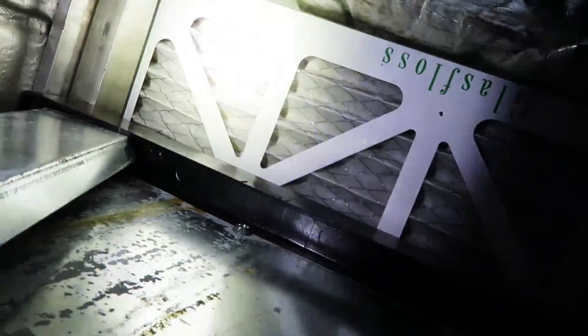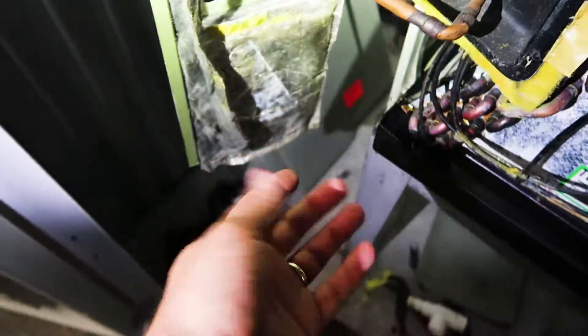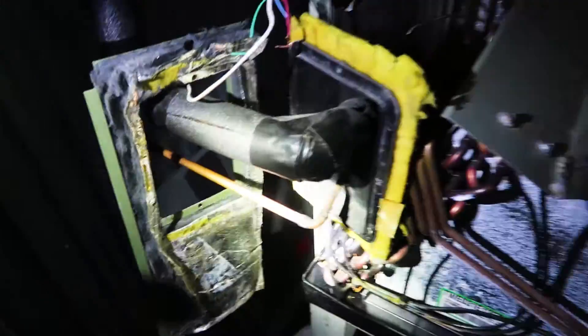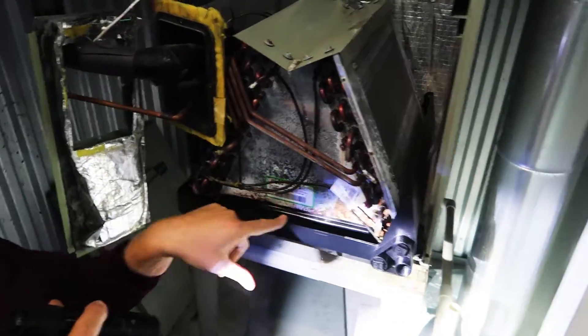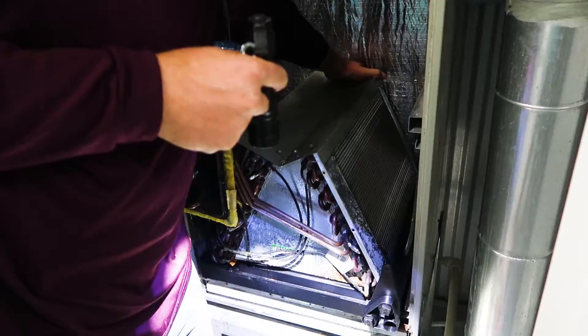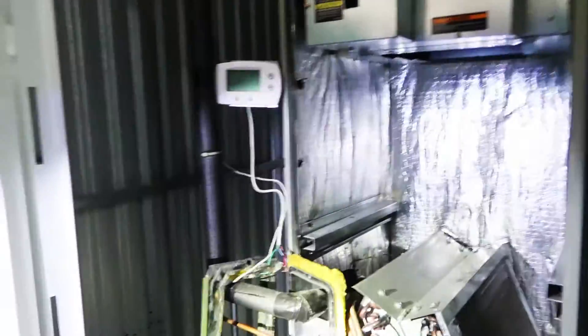In just about every application you can get the coil to slide forward a little. If you slide the coil forward that far, you can get right to the back of the pan — no problem. You've got plenty of room to work and blowers come out pretty easy. It really depends on how much play you have on your copper. In this case it's kind of an ideal situation because we've got this big riser and it gives you a lot of extra play. What I use is the clear tubing that comes with condensate pumps. Even if you just lift up the front of the coil, you can snake it under there, and you can get a drain pan pretty clean that way without pumping a unit down.